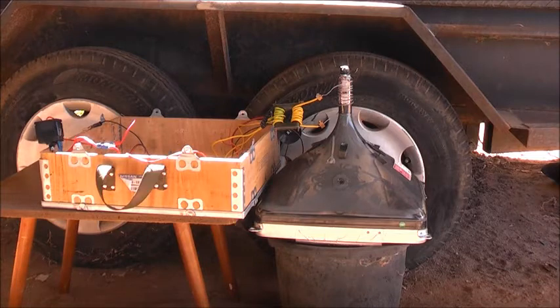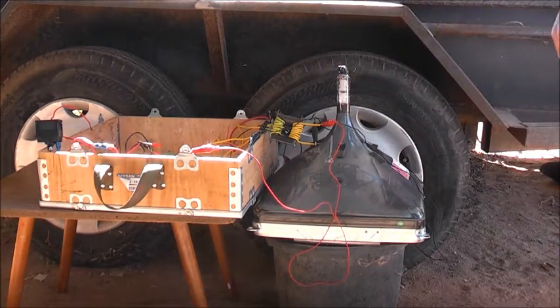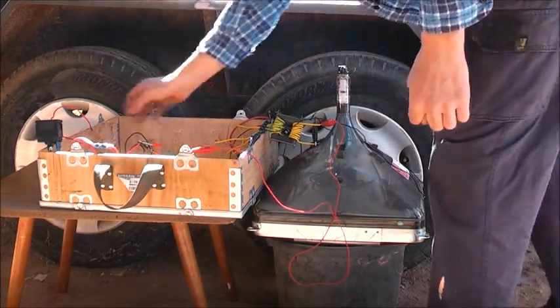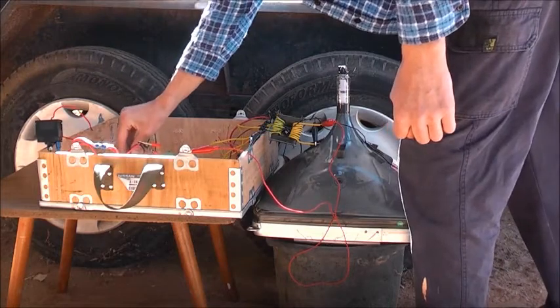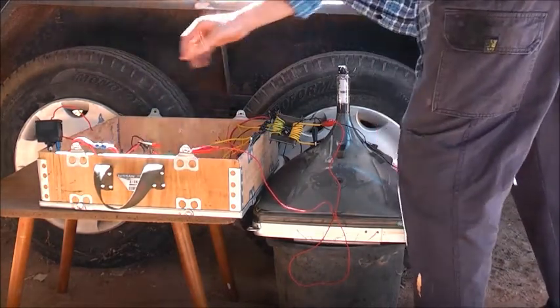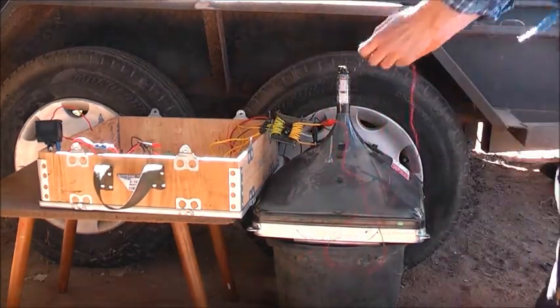All right, I'll remove that coil and just put some lead straight to the heater and just overvolt the heater with that ZVS induction heater transformer — it's not working out this way. Cook that electron gun. Off camera I got 58 volts and a lot of current out of this transformer — not quite as much as I thought, but I just had too much fun and blew the heater off camera. So I'll flip that back up and sort these out. Yep, 7 amps.